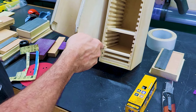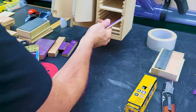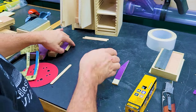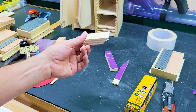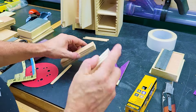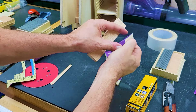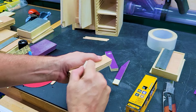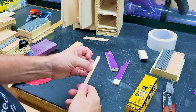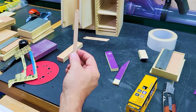You kind of get the idea — this is a tool you can make on the spot. There's one with a pointed edge, and there's just a long sanding block I like to use. I have leftover pieces from when I make French cleats. These are nice because I can hold them really easy — they're small, but they give me a finger hold, a place to push with my palm and hold with my forefinger, and give me a nice little sanding block. You could do the same thing with a plastic stick, an ice cream stick, or even emery boards.